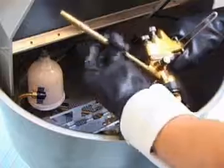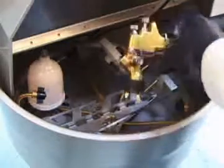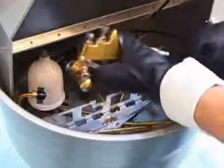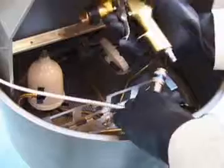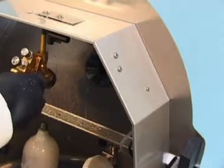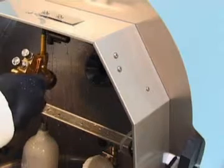The gun's paint channels can be rinsed with clean solvent using the clean rinse nozzle. Connect the gun to the air supply. Activate the clean rinse nozzle by pushing the pedal on the left. Clean the gun's paint channel and spray the solvent into the blowout funnel.